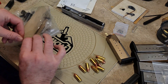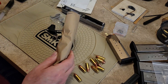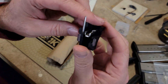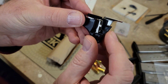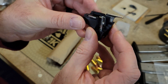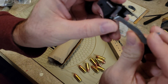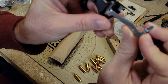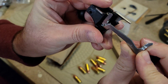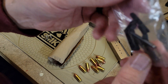Over here I have a bag with a lot of stuff — it's a complete parts kit including the sear block for an SD9VE. You can see how this one is somewhat different. Here's the trigger and how it works: the trigger bar loops around that, and when you pull back the trigger it pushes that back, then drops down and comes back — it just keeps doing that motion.